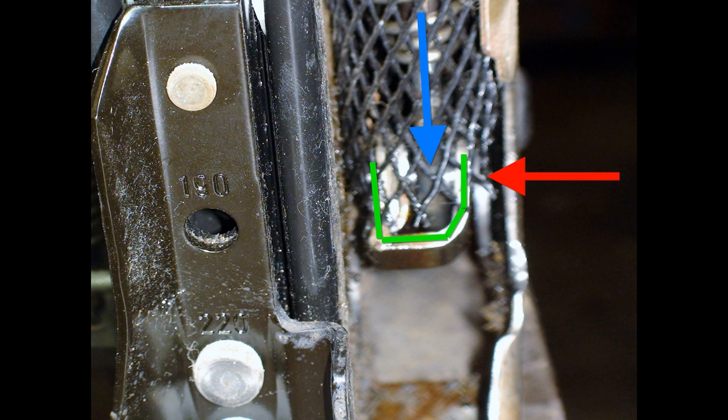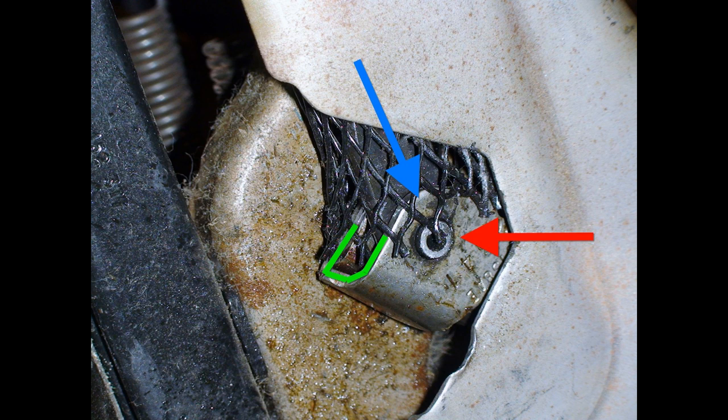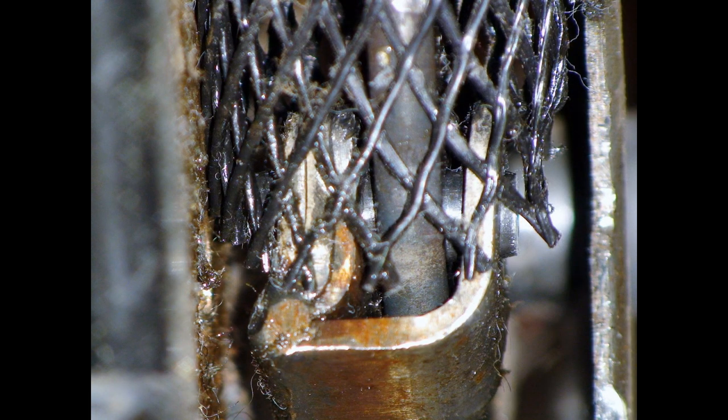The most difficult part is getting the spring-loaded shaft lined up with the hole in the collar so that you can reinsert the roll pin. The fourth picture shows these highlighted areas again, but this time from the side view and with the roll pin now reinserted. This shows how the three components must be realigned to enable the roll pin to be reinserted. The fifth and sixth pictures also show the roll pin reinserted from a front view and a side view to further clarify the positioning.